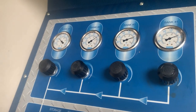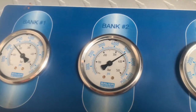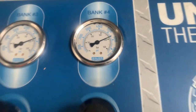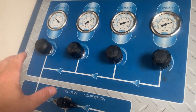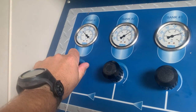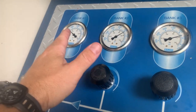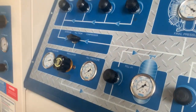As for the pressure gauge to know what's going in the tank, I'm going to be using that fill pressure gauge right there. Once I've got it open, I'm going to come over to my bank system and start on bank number one. Bank one right now has about 2,400 PSI. Bank two's got about 5,100. Bank three's got about 5,600, and bank four also has about 5,600. The cool thing about a cascade system is I can utilize all the air that's in storage and slowly fill these tanks, making sure I get a good accurate fill without the tanks getting too hot. I can slowly start transferring air from additional banks afterwards to get a more accurate fill.